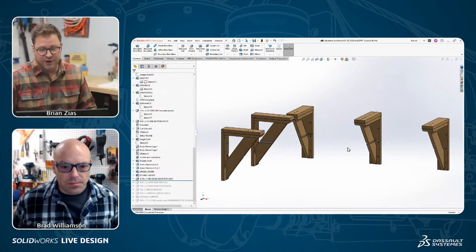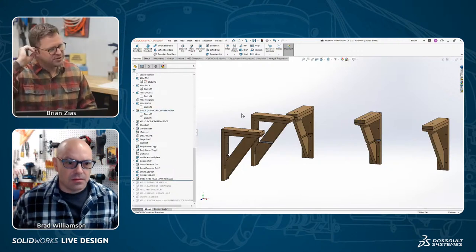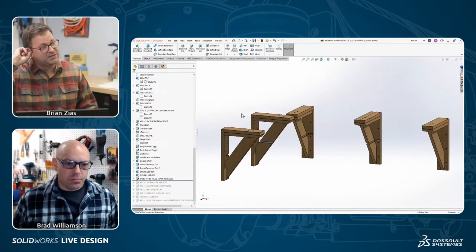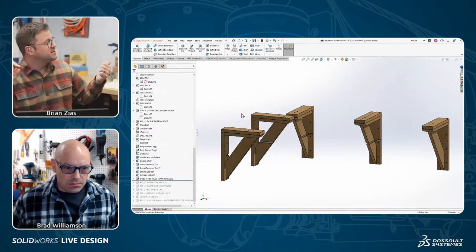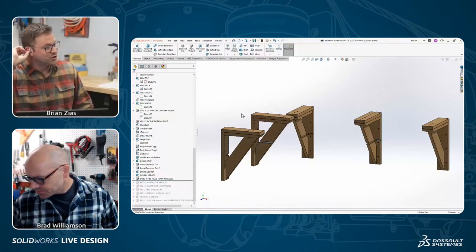But you know what took forever, and you guys can probably imagine, was drilling the holes for the Tapcon, because I ended up getting 3 1/4 inch, which means you need to drill 2.5 inches, I think, into the concrete. And those bits, I had to go back to the depot twice just to get new concrete bits. This is 70-year-old concrete. And what do they say? It hardens more as it ages. That took probably half a day just to drill all those holes.